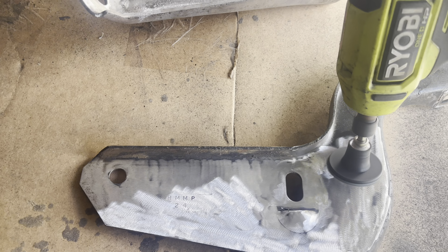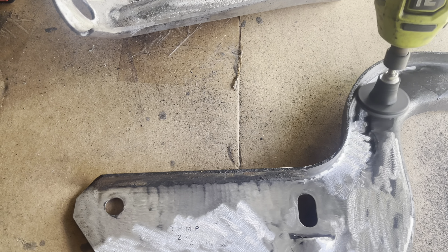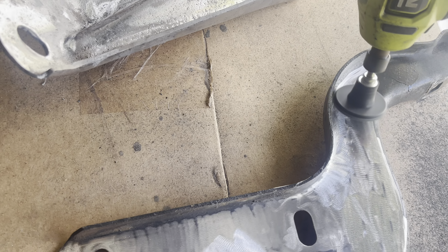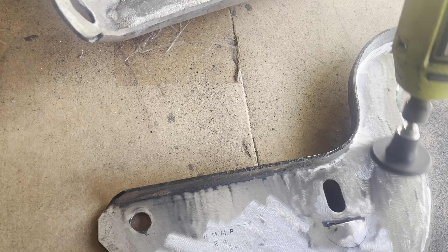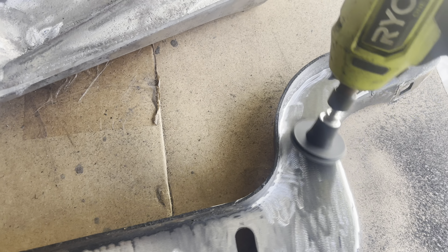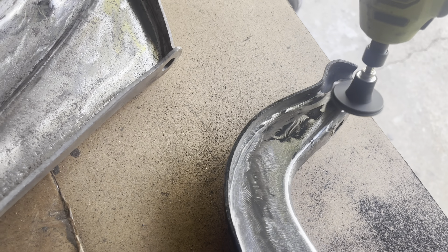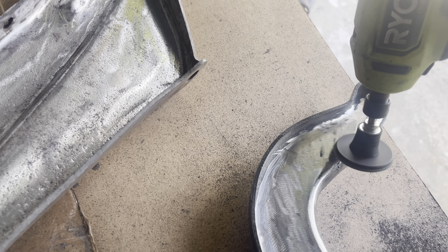This is just black paint that was on here. Underneath some areas of that black paint you will see rust due to pitting, but then there are some areas that were maintained and happened to be clean. We're removing all of that paint and all of that rust, and we're going to powder coat everything. There are some areas due to how this piece was made where it's hard to get in with the angle grinder, but I have different brushes and tools to get into those hard-to-reach areas.